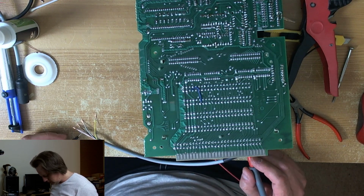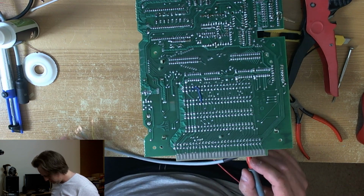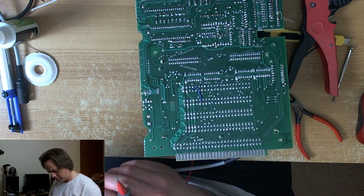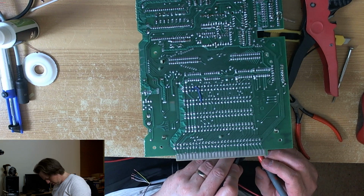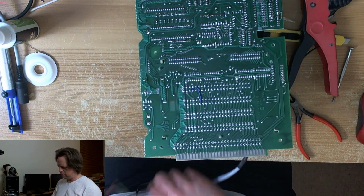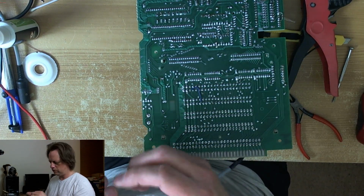Right, so is this. So the pink wire is connected to the shield. Yeah, so he's using shield and pink, so they are both entirely redundant, I think. Because the shield... Well, he has connected it to ground. So ground is connected to the shield at this end anyway, so it doesn't make... It seems to me it doesn't make any difference. I might as well just chop those ones off.